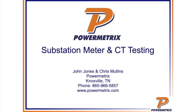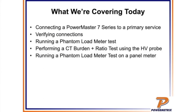We've been using our new training benches to try and show you some error scenarios, some different meter forms, some different meter services. Today, we are going to be talking about substation metering. So we'll be connecting a PowerMaster 7 series to primary service. We're going to be verifying connections, running a phantom load test. We're also going to be running a CT test. And we'll be using the 8016 or high volt probe that Powermetrix has.